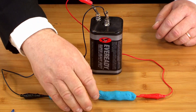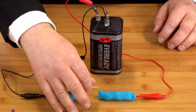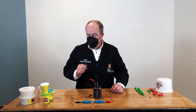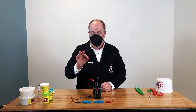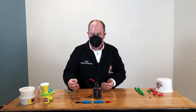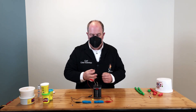If your LED didn't light up, watch this — if I just spin the LED around, it won't light up. LEDs act as a one-way valve for electricity. So if your LED didn't light up the first time, just flip its orientation around and it should light up. A word of caution: since we've got the battery here, it would be tempting to put an LED right across the battery terminals. If you do that, it's an experiment called burning out your LED — don't do that. The Play-Doh provides a little resistance to current flow so we get just enough electricity to light the LED without burning it out. Keep LEDs away from the battery terminals.